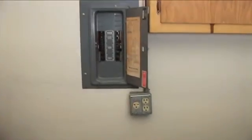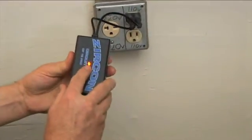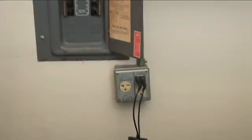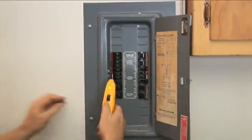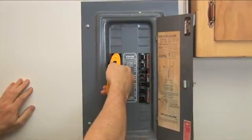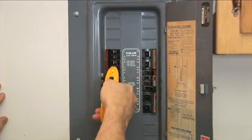Here's how to use it. Simply plug the transmitter into an electrical outlet and then scan your circuit breaker panel twice to identify which breaker operates that outlet. During the first scan, the CF12 may indicate more than one breaker as it memorizes each circuit.